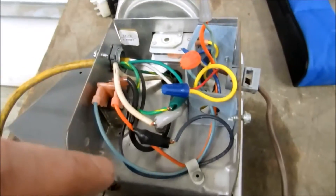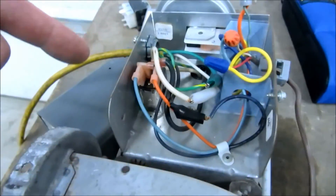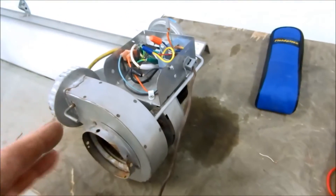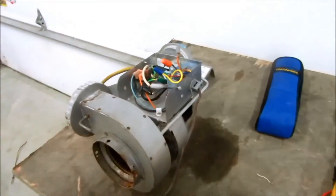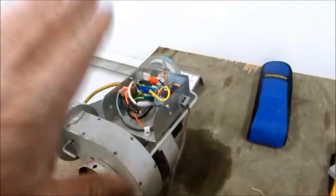It clicks the relay in, turns the motor on. This vacuum switch makes from this tube and we've got power to the burner. Now some of these have a post purge, which this one doesn't. As soon as I turn the thermostat off — disconnect this — the motor dies and shuts power off. If that relay goes, I would probably put in a heat sequencer with a delay. You can buy a kit for this that has a post purge, because this is a forced draft and after running the gas appliance you really need to draft for a while to get rid of the fumes in the boiler.